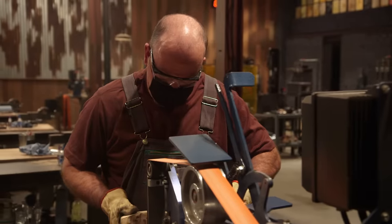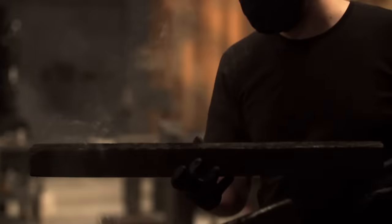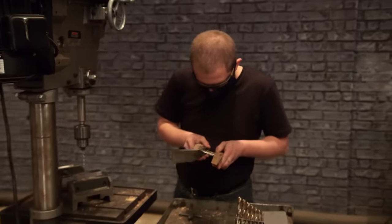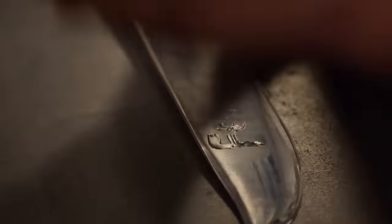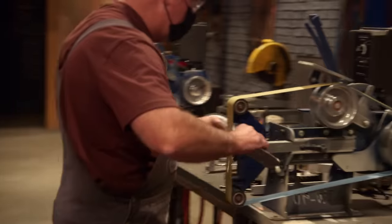I pride myself on putting a good handle on the piece that I make, because the handle on a blade is an interface — it's like a keyboard on a computer. I'm going to flare out the ends so your hand stays in a good gripping position. I don't think there's anybody else that burns their wood before they put it on the handle — that's only something you'll find on Forged in Fire. I'm trying to get the pins to go through. I don't want to force it, so I'm constantly going back to the drill press. I get it to go together and we're in business. My next step is to go over to the grinder until I get a shape that feels comfortable. I'm going to make this blade awesome. I find some clear nail polish, I paint 'Forged in Fire' on the blade, and I go into the acid for a few minutes.